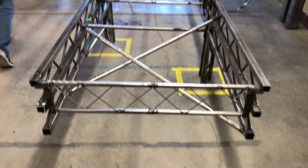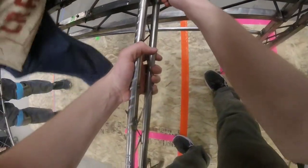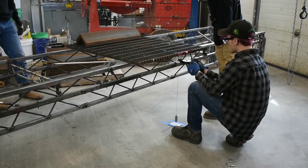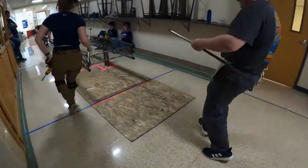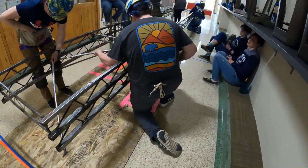Our bridge design has a deck along with a substructure, and then connecting the two sides are lats and kickers. We have five vertical lats. The vertical lats are there to stop side-to-side motion between the north and south sides of the deck. They're placed strategically to help minimize the sway points around where the lat tests occur. The kickers on this year's bridge have multiple benefits. On the cantilever, they provide extra support that the deck isn't able to provide. The kickers on the span provide lateral support — without them the bridge is really wavy and doesn't like to stand on its own.